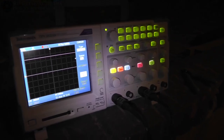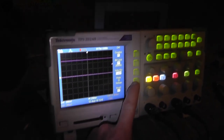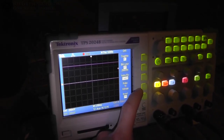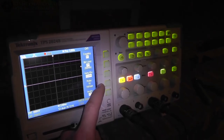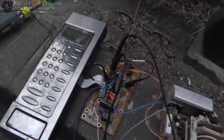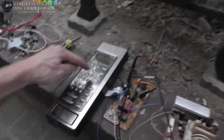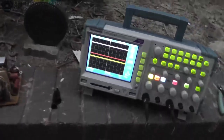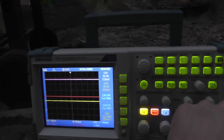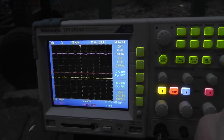So what you're about to watch was recorded earlier, and unfortunately I just now figured out that I had the oscilloscope probes set on times one, so everything is ten times off. Anything I mention is actually ten times higher — so five hundred millivolts is actually five volts. Just FYI. The oscilloscope to the rescue. I think I know which one is ground — it's the yellow one, I might be wrong. So we're going to try to start this and see what we get over here. We got a bunch of noise.